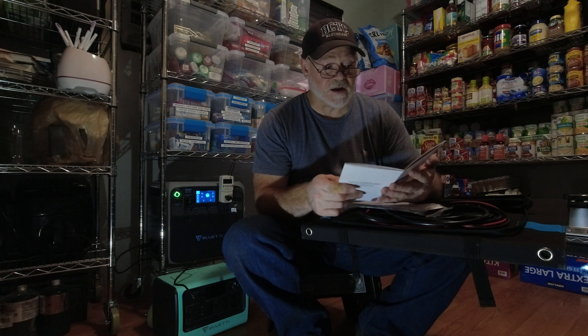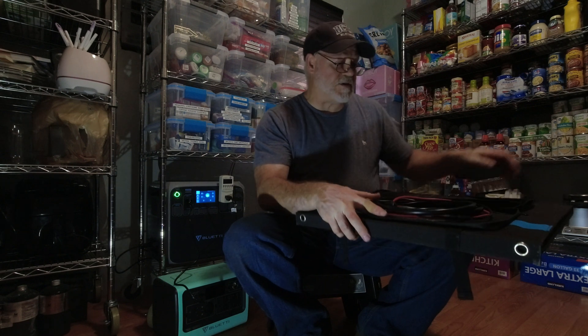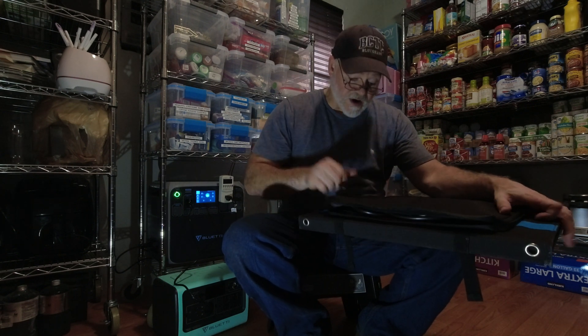You're never going to get 200 watts into them because the MPPT charge controller will limit the current and limit the watts to 150, so you can't over-panel those two machines with this panel. It works great. It's about 14.3 pounds — I'm just going to take them at their word for that. It is lightweight, not heavy, and easy to move around.